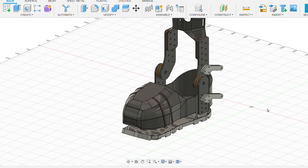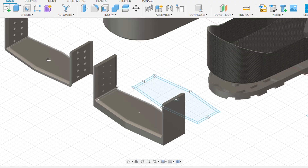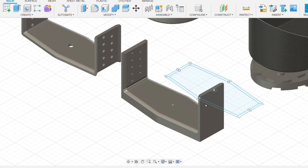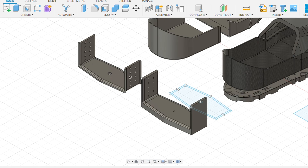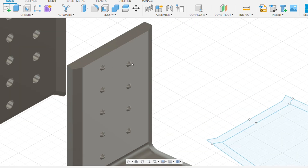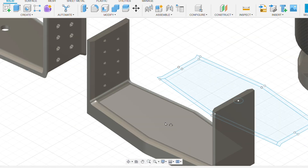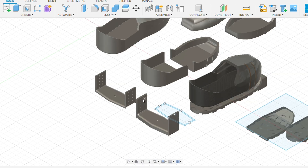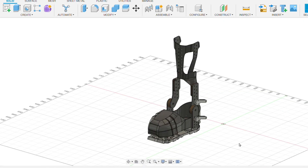For this U-shaped ankle piece that will be made out of carbon fiber, it will also have to be molded into shape, so I'm trying again at using 3D printer molds. This is the shape we actually need and this is the mold itself — we just lay the carbon fiber into here and cut around the sides of the mold. I've also got some small but sharp divots in here to help drilling the holes, which should allow it to come out a lot better than on the last episode. You can also see the boot tread mold that all the resin will be laid into.